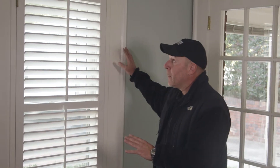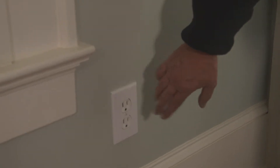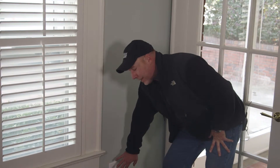What we have here is an exterior wall. A lot of people think you want to look at your outlets, which leak air, and they're going to take this off and put a foam gasket on here. But the problem with that is you still have six holes that are going to be leaking unless you put a baby cover on there, and nobody wants to do that.